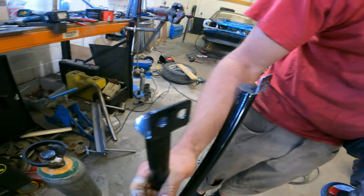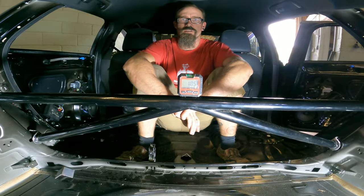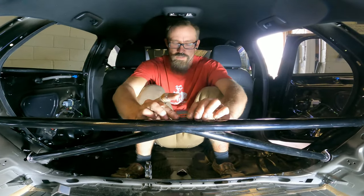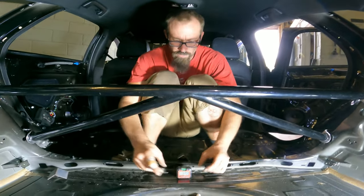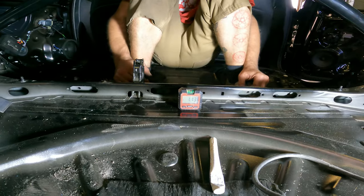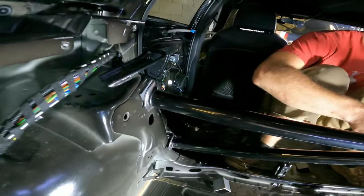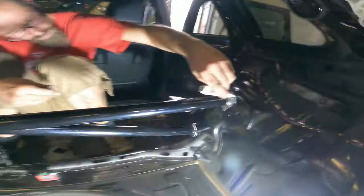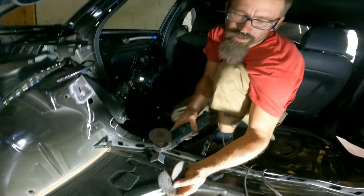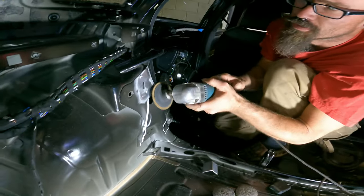It's just cleaning up, cleaning the paint off. A good clean makes for a good weld. 1.05. Yeah, it's pretty stable. Here and there it jumped quickly to 1.13, but not by much. And on this side it's the same, 1.05, so that's level. It jumped here and there to 1.13, so it's exactly the same behavior as on the K-bar. So, bang on. If I draw around these, I know where I've got to clean the paint off, with a Scotch pad so that it removes the paint and not too much metal.